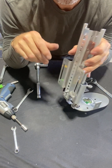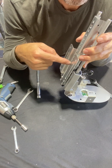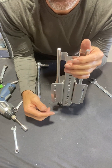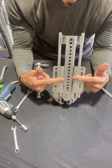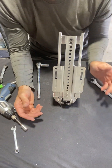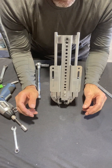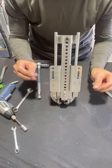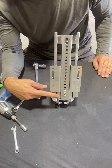We also always recommend, if it's an aluminium boat, putting this on a flat surface and having a barrier between the stainless steel and the aluminium — you do not want full contact with the boat. The best way I've found is simply the day before you install it, coat this area with silicone and let it dry. That way the day you go to install it, you've got that barrier already there. Install it, drill all your holes, make sure it all fits, take it off, do a nice neat layer of silicone, let it dry, and the next day come along and bolt it all back up.